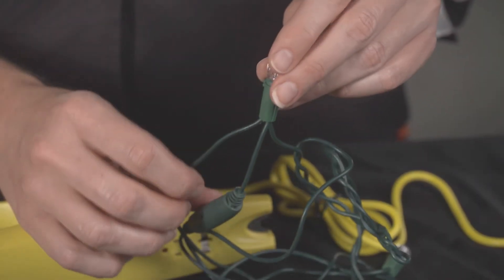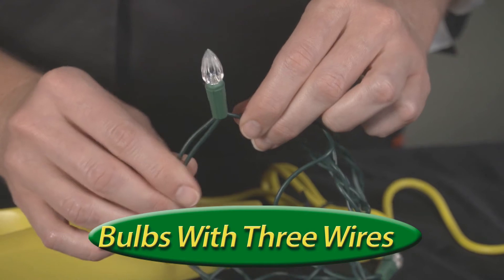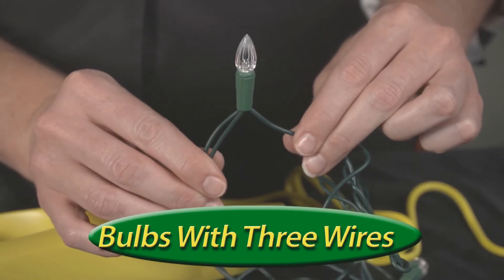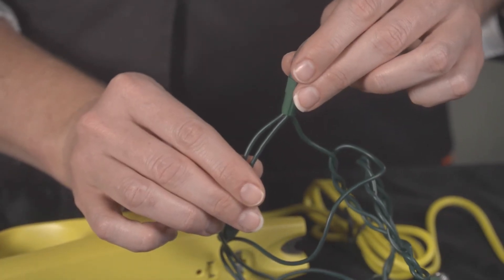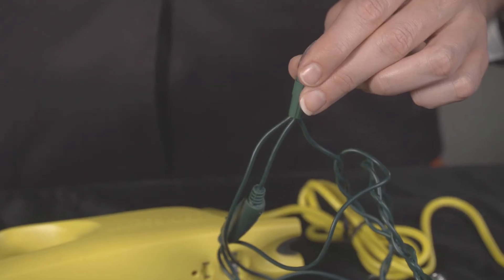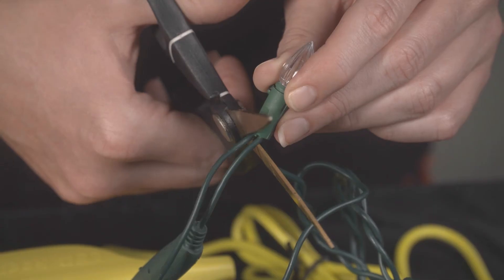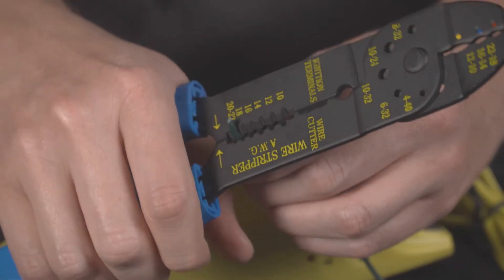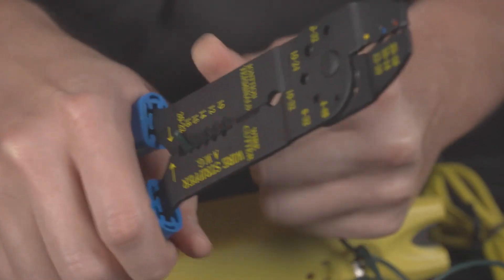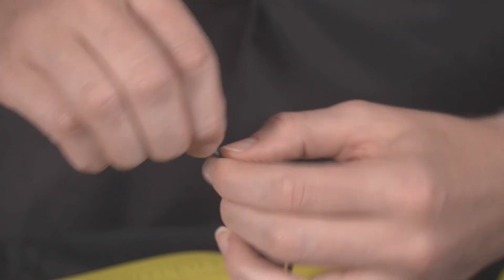Sometimes you will find the questionable bulb has three wires in total leading in and out of it. Two of the three wires will come out of one side of the bulb socket. Once the two wires have been identified, these two wires need to be kept together throughout the entire process. That third wire will be dealt with separately. With the light set unplugged, cut the two wires that are going to be kept together. Cut as close to the bulb socket as possible. You need to strip the insulation a bit in order to reveal more of the copper on the ends of the wire. Then twist the copper wire together to create one wire.